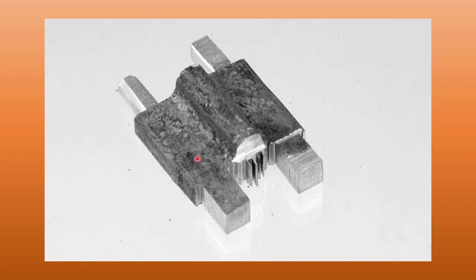For my grill I chose to make a narrow bead within the collar, and therefore was obliged to cut two tenons rather than try to get a tenon in the middle of that narrow bead. Tenons don't have to be round, but certainly a round tenon does make it easier to make the mortise.